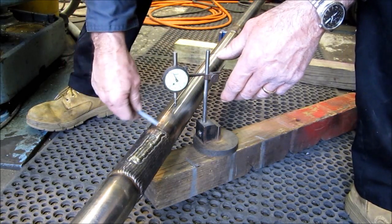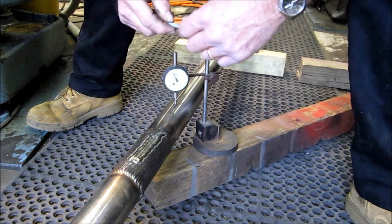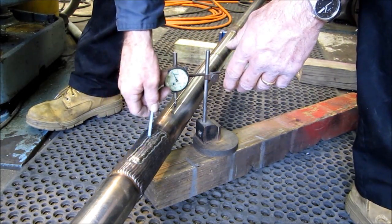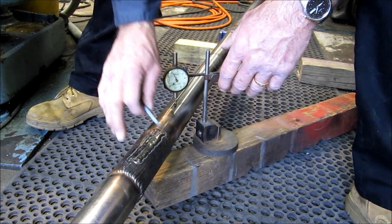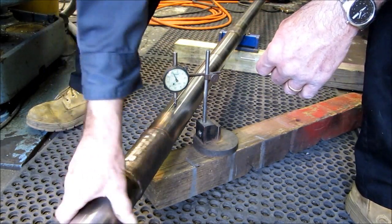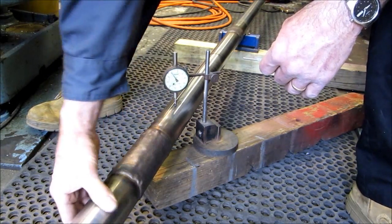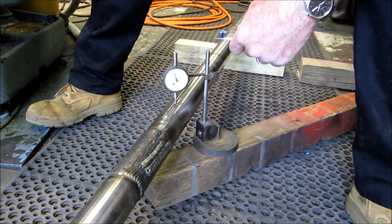Anyway, we had about 25 thousandths runout down here, and we had about 10 thousandths down by the packing area we repaired. We came in here and we put three weld beads on here to contract this side of the shaft and create our draw. The same, one bead down on the other end. We're now running within 2 thousandths at this end here, if I don't shake it too much, and less than one down at that end. So let's get it in the lathe.